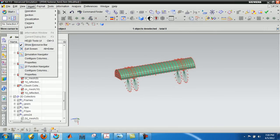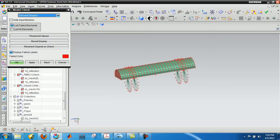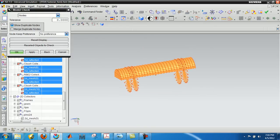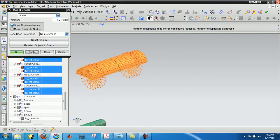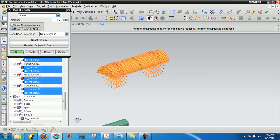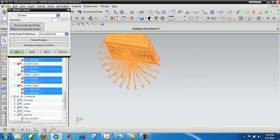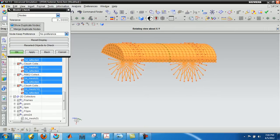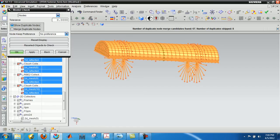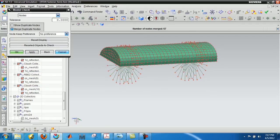This is another good quiz question. For the quiz I'll actually perform some maneuvers up to the point just before running the model check and ask what results would be expected. Giving apply, we expect the same 67 duplicates that showed up when we mirrored the pin without the spiders. Running Show Duplicate Nodes shows 67 found and 8 skipped — two from the big frame, two from the small frame, and again two from the small frame and two from the big frame on the other outer side. It grabbed the right ones and knows to merge the right ones. Give it apply and everything is pretty much set.